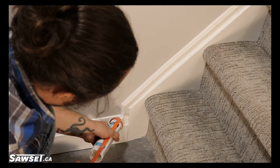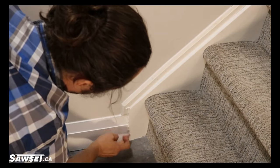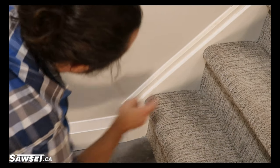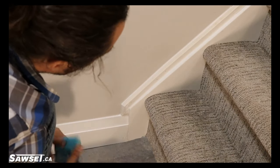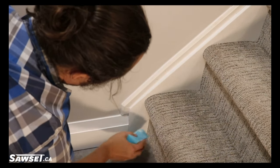Get a good soft sponge — I know a lot of guys use a rag or just wipe it off on their shirt, but get a good soft sponge. Wring it out so it's barely wet anymore and use it to smooth it all out. Think of it like pottery — you're just smoothing out your corners, smoothing out your angles. Wipe it all down in the end and you're going to have beautiful trim that will last as long as you will, hopefully.